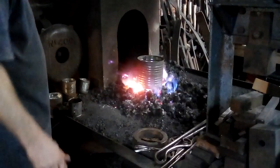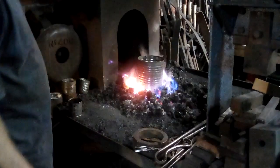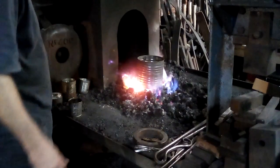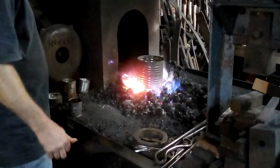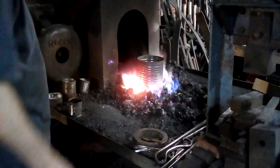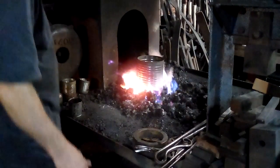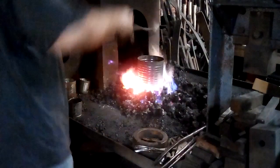That'll make the tannic acid react with the iron scale, the iron oxide, and it'll also remove some of the water, because the other thing is that it's way too thin. You need to reduce it down a little bit, as well as react it.